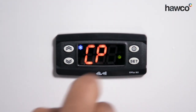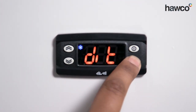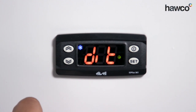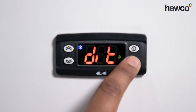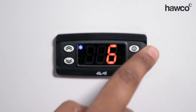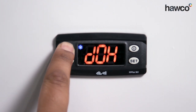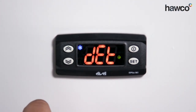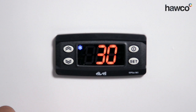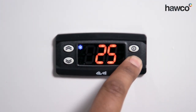That's all the ones we're going to talk about in the CP folder. Press the on/off button once to come back to the folders. We're going to go into the defrost folder. The first parameter is quite important — this is the interval between two defrosts. It's set to six hours, meaning every six hours it will go into defrost regardless. We're quite happy with that. Next is DET, the defrost timeout — this is the maximum duration of defrost allowable, set to 30 minutes. You can reduce it to 25 or increase it depending on your application.